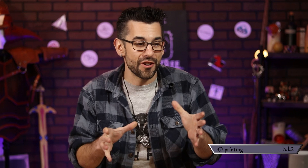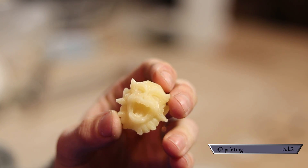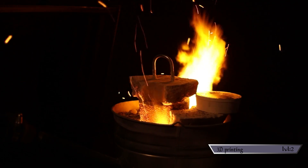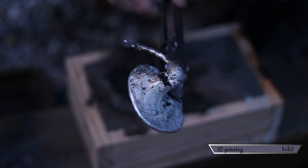I genuinely don't know why the metal casting failed, and I don't want to get too into it because it's a skill I want to revisit. I cast it in plastic, used wax inside the mold for a lost-wax casting, buried it in green sand with a sprue hole — the whole nine yards. I was up until 3am and no dice. Being frustrated means you care. As long as you don't let it control the process, step away, breathe, think about what went wrong, and tackle it smarter next time.